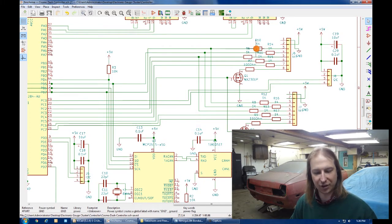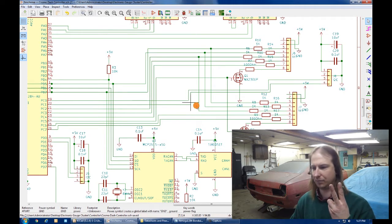Now, because a screen is just an output device, they only require the 2 SPI lines plus a reset connection, which can be shared between both screens, and the data or command select line, which has to be unique per screen, and the chip select line, part of the SPI bus, again unique per screen. So I ended up using only 5 data pins plus the two SPI pins for the screens.